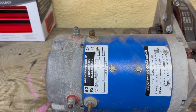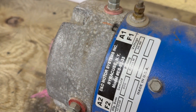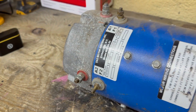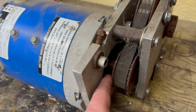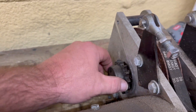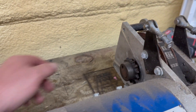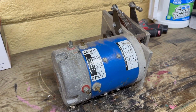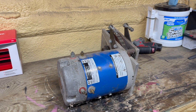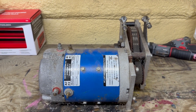So this is the motor we're going to be testing — a D&D ES-93-33 motor. It has your A2, A1, F1, and F2. It has a keyed shaft output. We're in a belt drive system here and it has a sprocket on the other side. This belt drive is just acting as a jack shaft. I got this from the Sun EV truck a few years ago on the channel. I was going to use it for a bagged cart project, so we might be seeing this relatively soon.